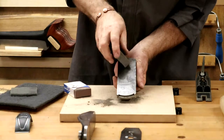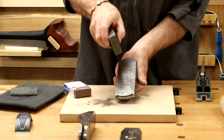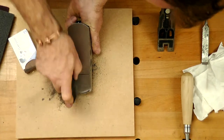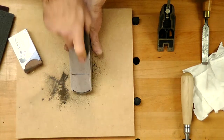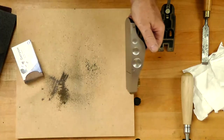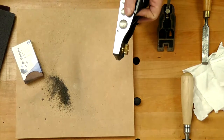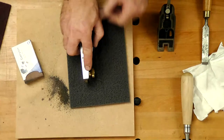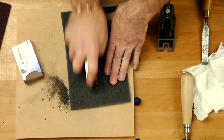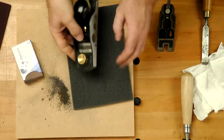So Maria, you said about your lathe bed. If you've got somewhere where you get a bit of rust, this would be a good way of going. Don't go using normal abrasive paper. You tend to scratch things more. If you have a machine bed, router table, bandsaw table, and you have an orbital sander, fine grade can be really good for that. That will help clean up. Something like a 400 grit, 240 grit, 400 will be really good to sand the surface lightly, give you a nice pattern that looks uniform.